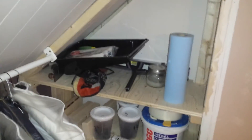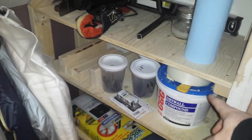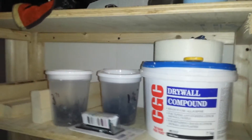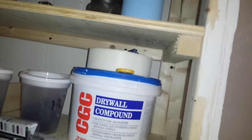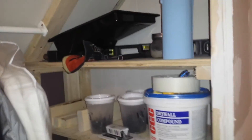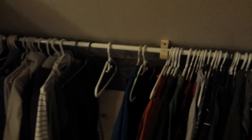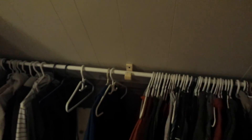With the basic frame in place, I cut the 2x4s in half and made each of the supports — one along the back and on the sides — then used 3/4 inch plywood for the shelving, which I will paint and cover and trim around so you won't see it. I did the same thing on the other side. I also made a little wooden hook here to sit the pole in, just gives the pole some support in the middle so that it doesn't bend under all the weight of the clothes.